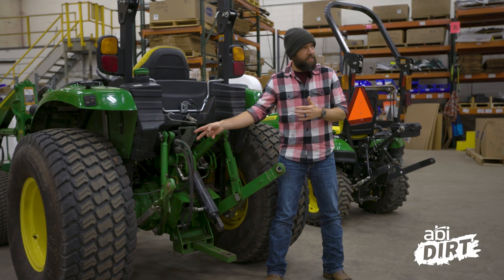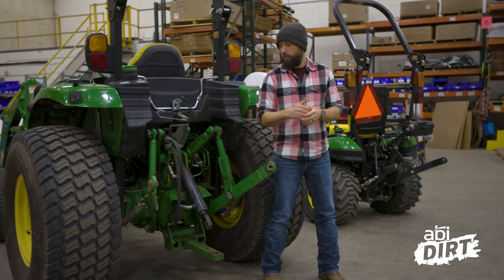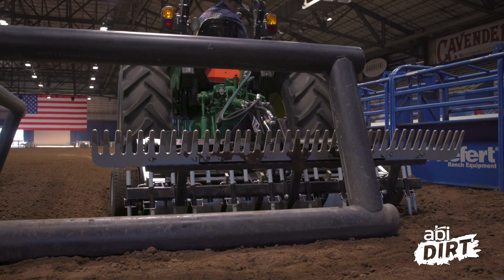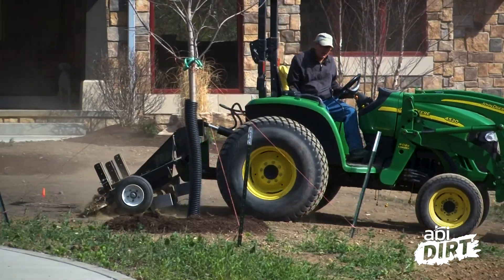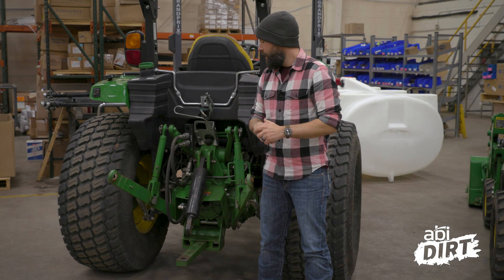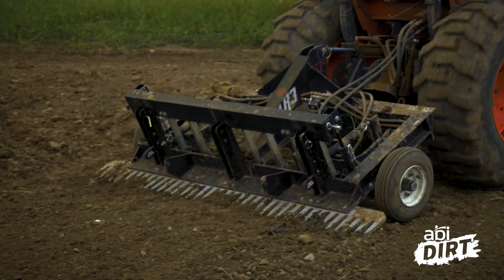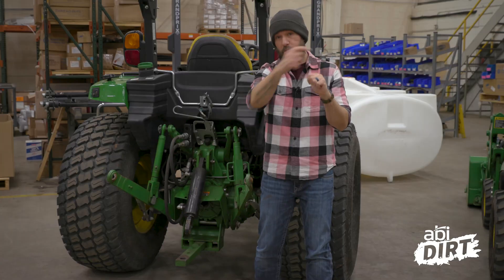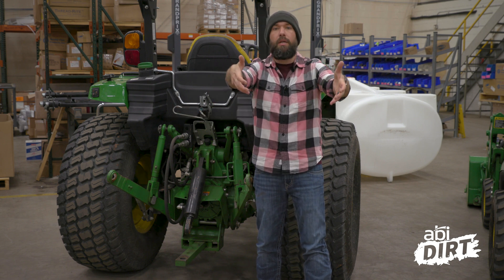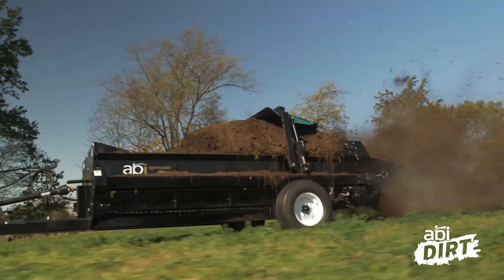Whereas your hydraulic system — with these rear-facing remotes on the back of this John Deere 4 Series — is typically used for more intermittent power. Think cylinders that have to go one way or the other. For example, a pull-behind drag that needs to be raised and lowered off the ground uses hydraulic cylinders. On our Tier 3 SR3 line, we have scarifiers that can change depth on the fly for gravel driveways or arenas — those require hydraulic cylinders. On our larger manure spreader models, the hydraulic system raises and lowers the end gate for transport position.